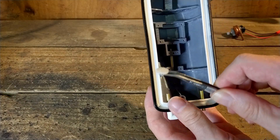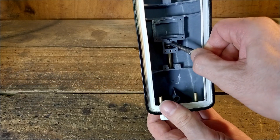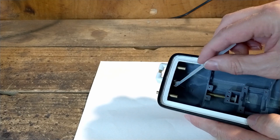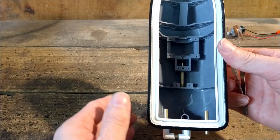I chose this gear because it's what I had on hand, and it works with the pinion gear to give a 2 to 1 reduction ratio. I then install the rudder sleeve and use a small amount of silicone on both ends. The way this has been designed is so that if there's a problem with the rudder sleeve or the prop sleeve they can be removed, fixed, or replaced. Everything about the creation of this boat is done in such a way that most components are removable and replaceable — I wanted to avoid having things permanently glued in place, apart from the motor mount, but this is one of many things I plan to fix in version 2.